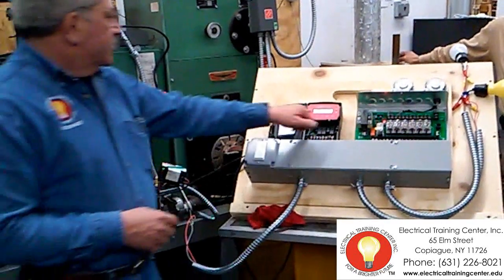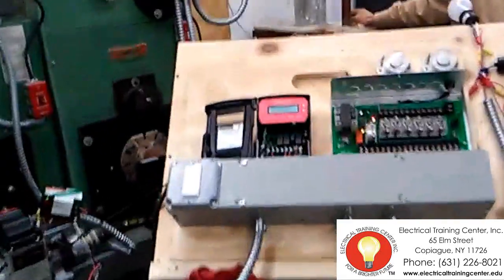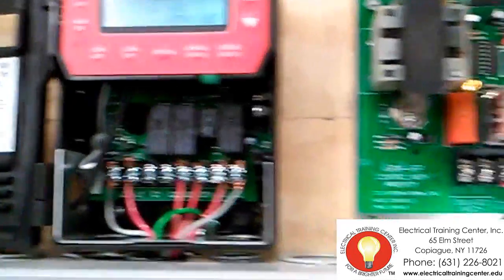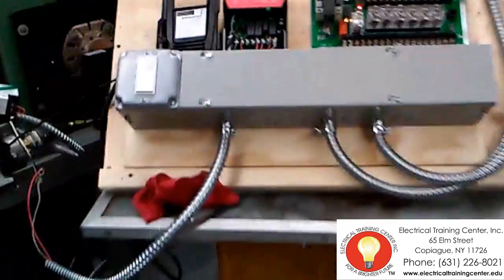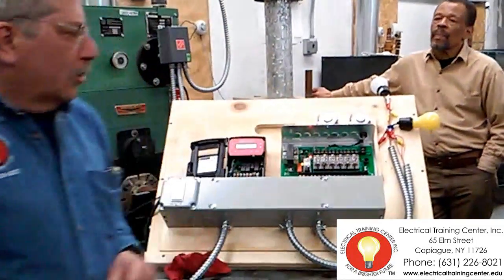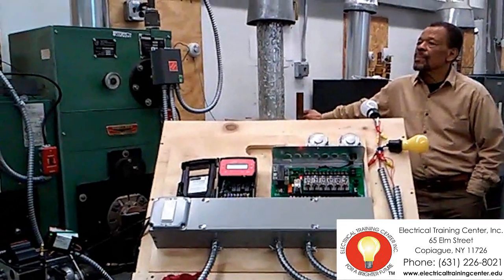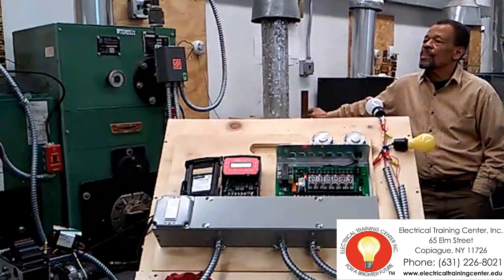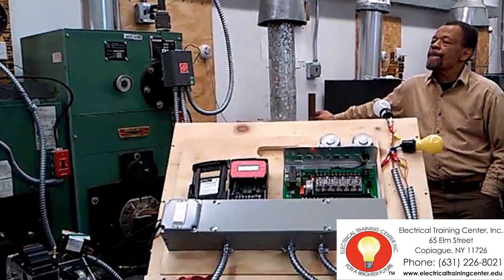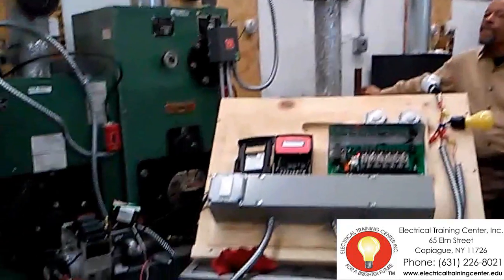Right now, the water inside of this boiler is cold. You can see the temperature in the boiler is starting to rise. We started out at about 79 degrees. We're now up to 82, 83 degrees. That will continue as long as the burner is operating. Zone two would be the same exact thing — we are calling for heat. The Argo zone panel is telling us we're calling for heat, but we're not going to get circulator operation until the water temperature in the boiler is up to an appreciable point where it will do some space heating when that circulator turns on.